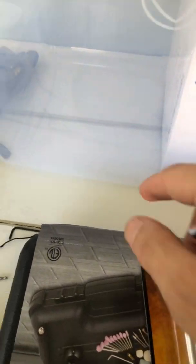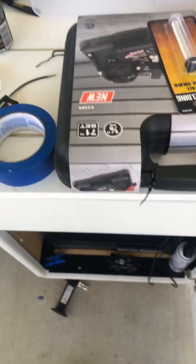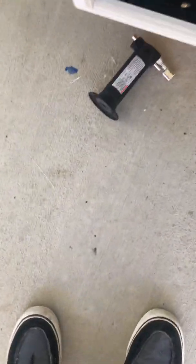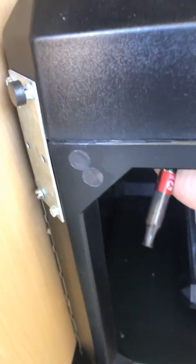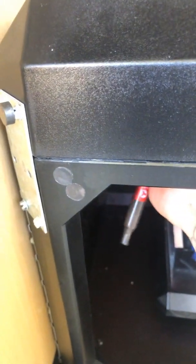I'm obviously in the process of building my own little case to keep my PLA and all my materials nice and dry. I just want to touch on all those items. A lot of times people have issues with this printer going loose - quick fix for that, there are just a couple of screws on the inside back here, actually just one screw that tightens the belt. Just tighten that down and that'll solve the issue.